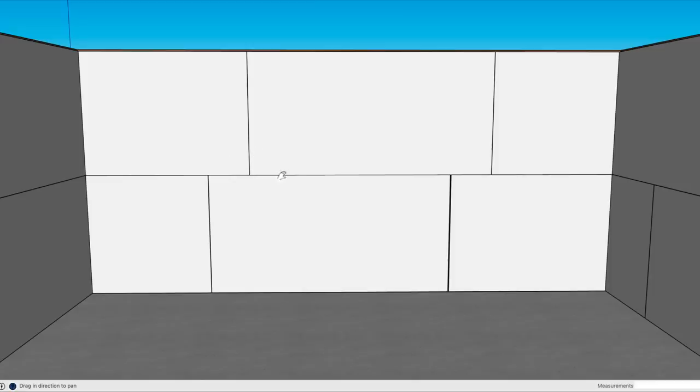The two long sides of the drywall are tapered. This beveled edge is 1/8 inch thinner than the rest of the drywall. Always place beveled edges next to each other. Whenever possible, place your cut edges against the corners where they'll be covered by trim or another piece of drywall.